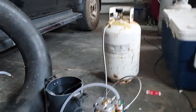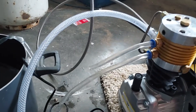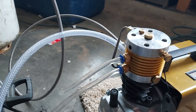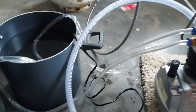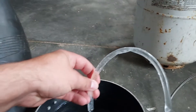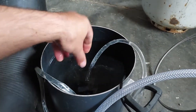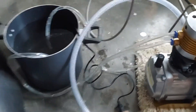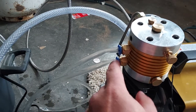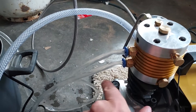This compressor needs to be cooled — it's water cooled. Even if I'm just trying to go up to a couple hundred PSI, if I run it without water it'll overheat and shut down. It came with a submersible pump and I have to run this to run the compressor. If you get a similar compressor, that's the inlet on the bottom and always the outlet on the top, so you know it's full of water and not just trickling out.